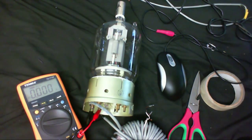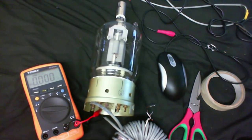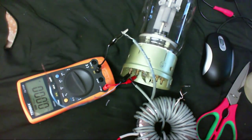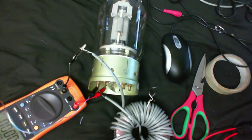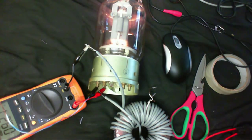I'd like to know how much current that's actually pulling, but my meter only goes up to 10 amps. Oh hell, I'll do it anyway. So let's plug this in and see if we can measure the amount of amps this is taking. This will probably be too much for my meter to measure, but we'll see. Alright, we're drawing about 9.1 amps.